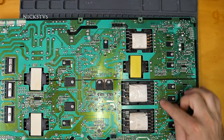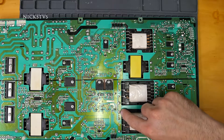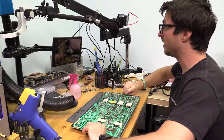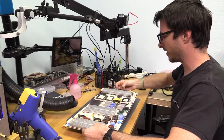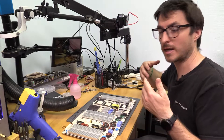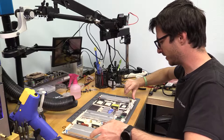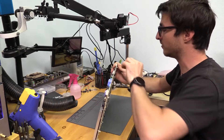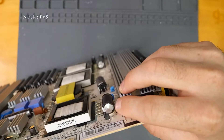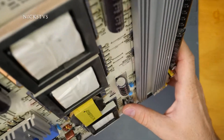For this board specifically, we can see cracked joints on these larger transformers on some of the legs here. We'll zoom in on those with our other camera in a minute, but before we do that we actually also found bulging capacitors. Bulging capacitors happen on LED boards, LCD TVs, plasmas — it doesn't matter what it is, we see it on all of it. Looking here, this capacitor is rounded out at the end whereas the other similar one on the other side is very flat.